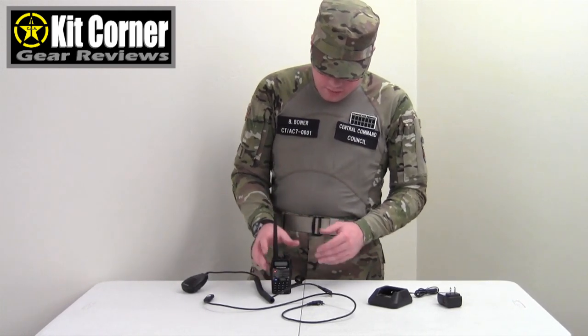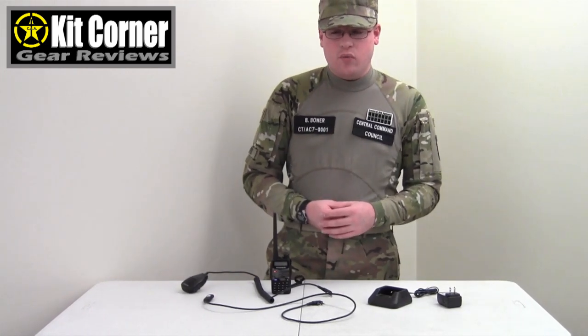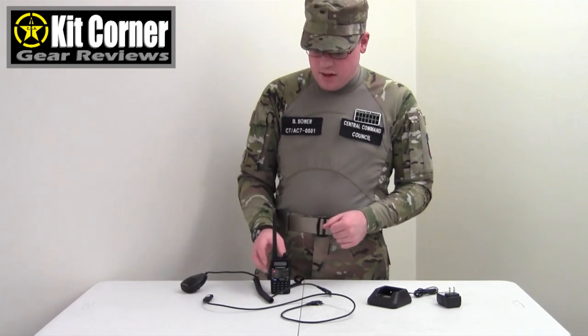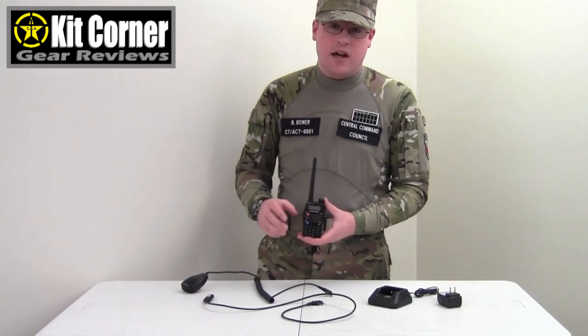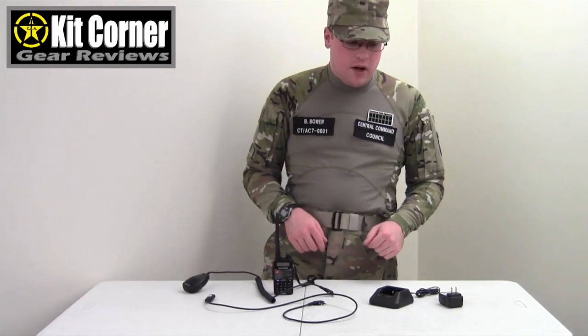This little radio is pretty small and compact. Service-wise out in the field it works really good. You can use repeaters with it obviously, but without a repeater we have ranges of around 5 to 6 miles depending on terrain and atmospheric conditions. That is with the high power setting. These are 4-watt radios and they can transmit on either 4 watts or 1 watt, so you can turn them down. So if you are using MURS, which has a watt restriction, you want to turn them down to the 1-watt setting.